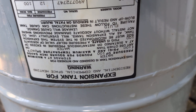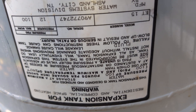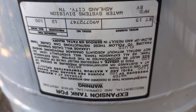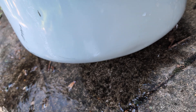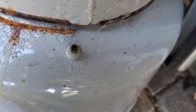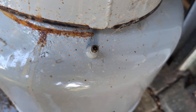What we've got here is an expansion tank and it is upside down — put in a while ago. State water heater, no longer made, the outlet is at the bottom. You can see it's still draining. The first thing I did is open up the Schrader valve and I wasn't getting any water out of it, and it was not getting any air, so I was going to go ahead and pump it.